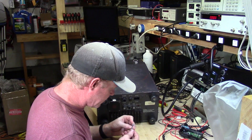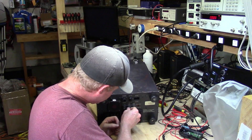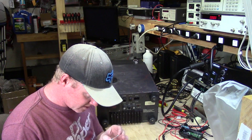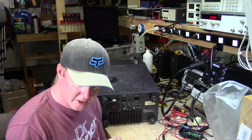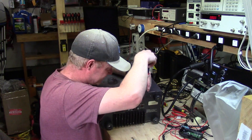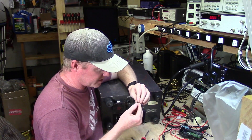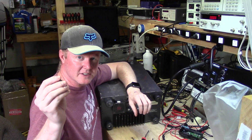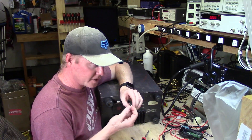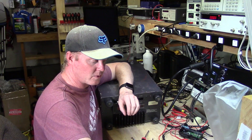We know we need to take a look at the power supplies first. On this particular unit, the low voltage supply more than likely has an issue. It may be something upstream from this, but we'll take a look. One thing I've noticed on at least these Motorola supplies: they have little washers on the screws and you need to be real careful not to lose those. If you do lose them, make sure you put a little bit of blue Loctite on, otherwise they'll work loose on you.